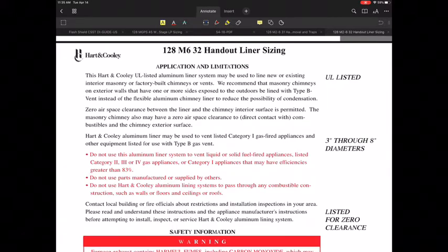The liner is much lower mass, and it might be a really very good system on there. There are other systems that might be better. For example, a hard B-vent pipe might be much better, the fact that it's much smoother on the walls, whereas most of these chimney liners are very corrugated, so they have a lot higher resistance than what is normal on there. So you want to be a little careful on some of those things.